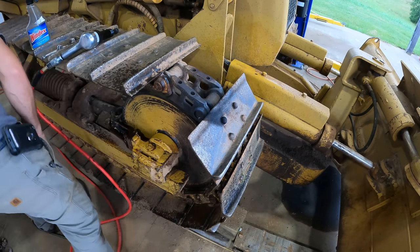This rail is so big I think on camera it doesn't look that bad, but that's about half an inch of metal that's missing — maybe three-eighths — right here on this edge. The shoe only comes out to there, so the vast majority of the surface the shoe rides on is gone. You can see there's a previous shim that was welded on — it's totally gone. I need a new wear surface there, and I need to fill that in. That's bad, and if you let that continue to wear, eventually it's just going to break, and then you're replacing parts that could be well over a thousand dollars on this old machine.